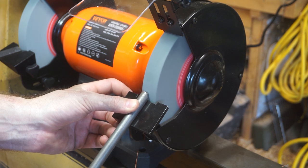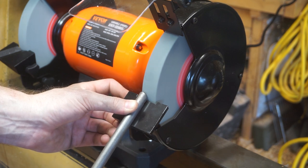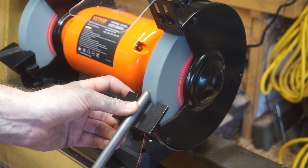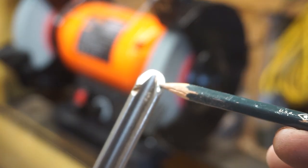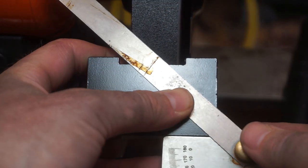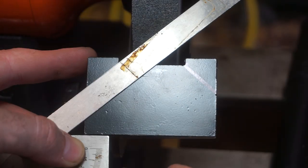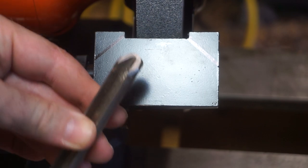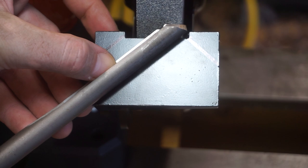We'll just gently touch it and go back and forth, side to side. Rub the tip of the tool on the grinder nice and slow to start. Now that it's all flat, you want to remove the outside metal and be left with the 40-degree cutting edge on the inside. The protractor is set to 40 degrees, so it'll mark some lines on the platform. Now we'll just repeat on the other side. Align your tool parallel to those lines and grind the 40-degree angle when you're removing the material, going back and forth like so.